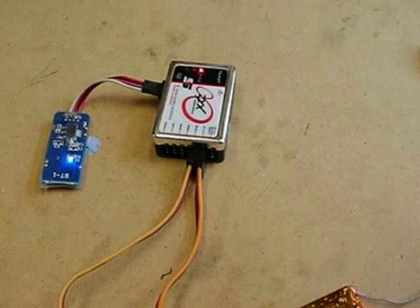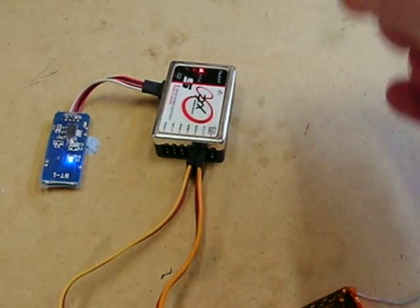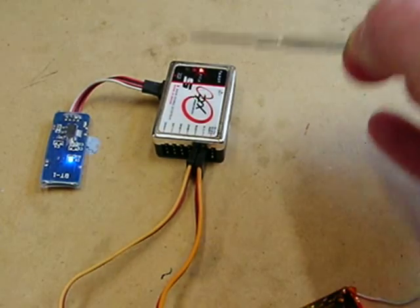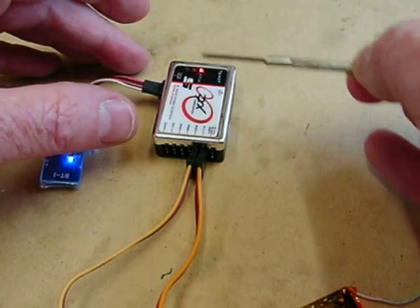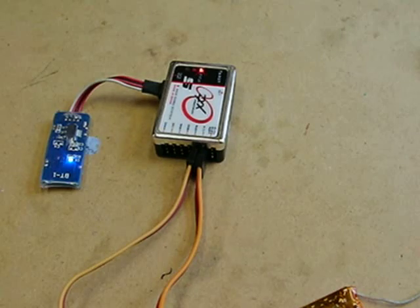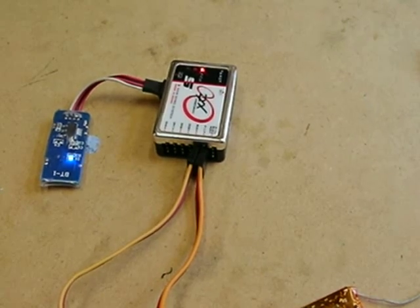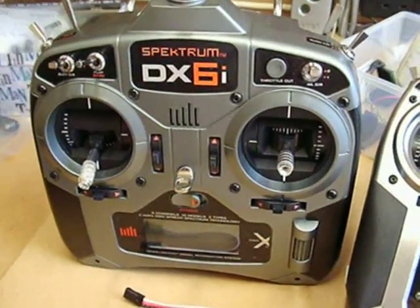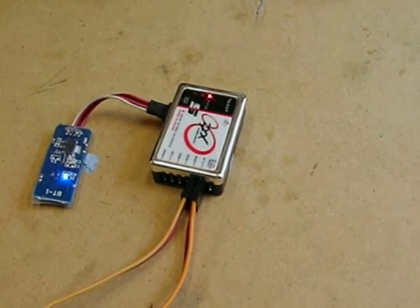If it doesn't work, go right back to the beginning and start the process again — otherwise you get yourself in knots and can end up with a yellow flashing light. Incidentally, if you do get a yellow flashing light, the workaround is to plug your power into channel one, power it up, and then press reset until it flashes. If it comes back flashing yellow, press it for a good two seconds and the yellow light will go out — when you let go, it'll come back red. The software will connect once it's red or blue, but will not connect if you've got a flashing yellow. I've tried this with the DX6i as well and that all seems to work. Thanks for watching — if you have any problems, contact us on the RC Groups ZYX Tarot forum. Thanks a lot.